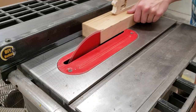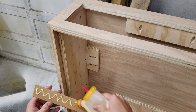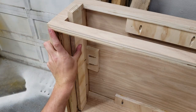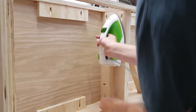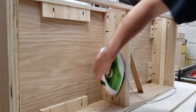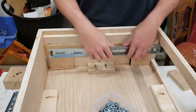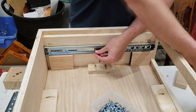To deal with the thickness of the edge banding ironed onto the sides of the openings — along with the three-quarter-inch plywood not being exactly three-quarters — I had to cut shims to make up the difference for the drawer slides to fit properly. The outside piece was a thicker piece of oak glued in place, and for the inside shim I used a couple strips of iron-on edge banding. Once the glue dried, I removed the temporary straps clamping the piece down and started installing the drawer slides, using spacers to ensure all four are the exact same height off the top.